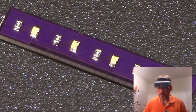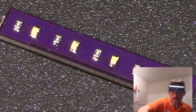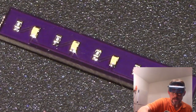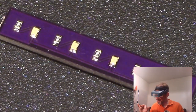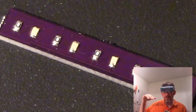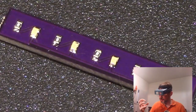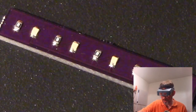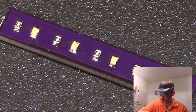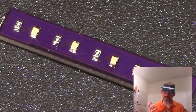All right, well, how about that? I think we are done. This has been going on for about 10 minutes now, and the solder paste has turned from a paste into a sort of a flat goo, and then it turned into what you would expect, that bright silver color. It looks like mercury or something, right? It's shiny and it is an actual solder.